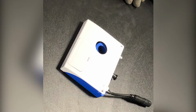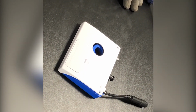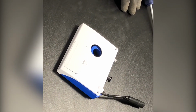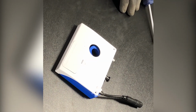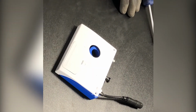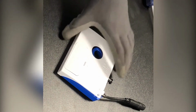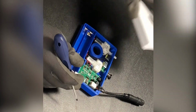If you're having problems with your cistern not flushing the full amount of water from the cistern on a full flush cycle when you wave your hand past the sensor, and you've checked the flush valve performance and you've checked all connections inside the cistern, it's then worth looking at the control box. To access the control box, remove that from the panel in which it's mounted, and then with the control box, you'll unscrew 2 Phillips screws to get inside the control box.